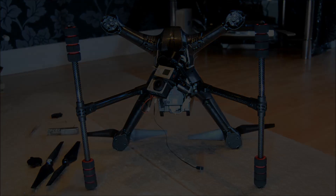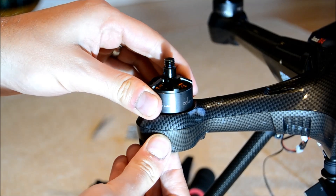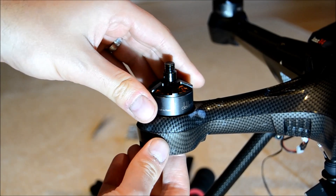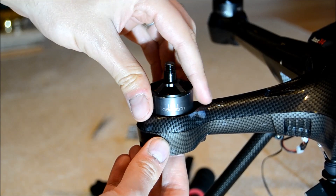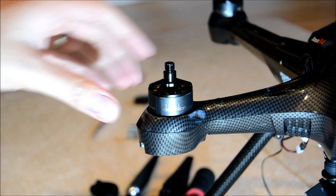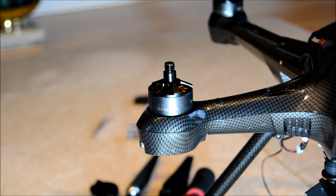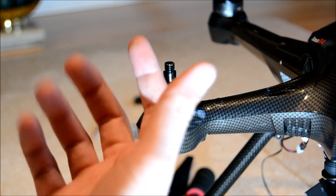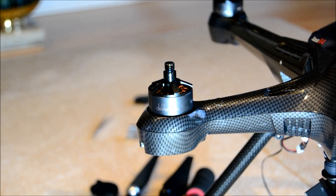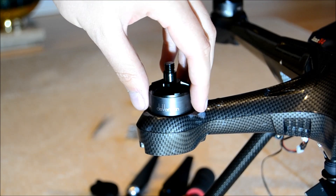Because the C-clip is missing, you can actually lift up the casing. With the C-clip in place, that would hold it in there, but as you can see it's lifting up and down. I need to purchase another C-clip to lock that in place. Until I receive that, I'm not willing to risk putting it in the air, because at the end of the day these things are in place for a reason. A C-clip needs to be clipped in there to stop the casing from moving upwards.